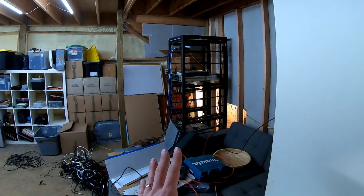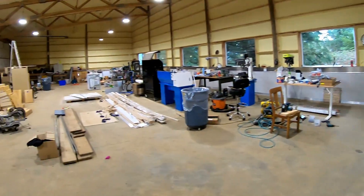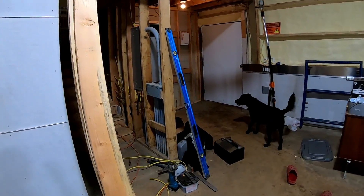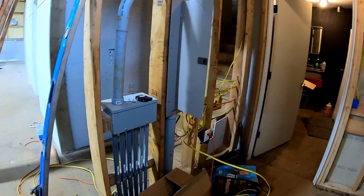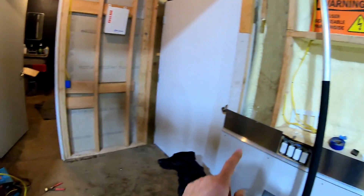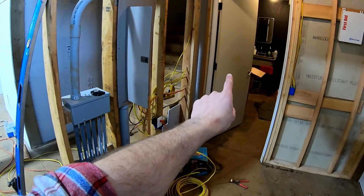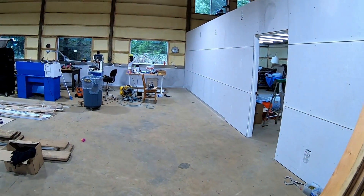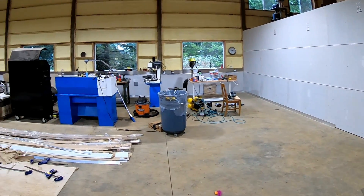I've also done some electrical — they're switched. I'm getting my servers on their own circuit. I've got another circuit for the hydronic system. The electrical's gotten a lot messier than when I started. I probably should have planned out these runs a lot better because I'm trying to avoid drilling through too many of these posts. A lot of the wires run that way under the stairs, around and back — a circuitous route, but it means fewer penetrations through structural posts.